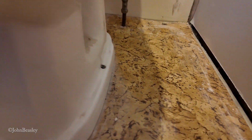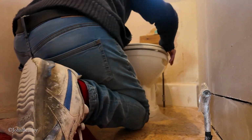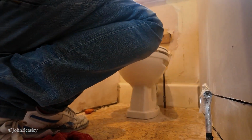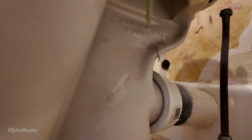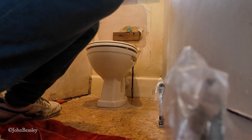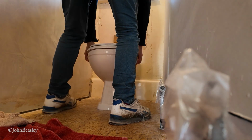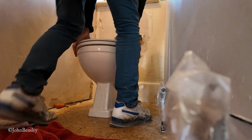And that just leaves the two big fat screws that hold the pan down into the wooden floorboards. Right, so with those two screws extracted, the whole pan is now ready to come away. It should just pull out of that connector there, which is called a multi-quick. It should just pull forwards and the whole pan should come out. Let's see. And there she goes.